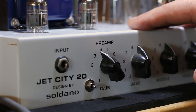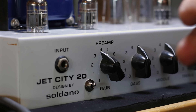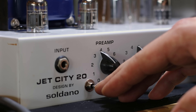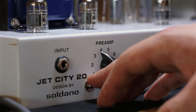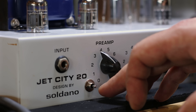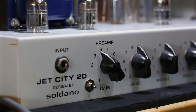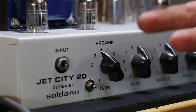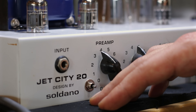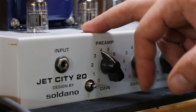The EP3, if you're not familiar with it, is the Echoplex unit, and a lot of great guitarists got their sound by running through just the preamp part and not actually using the echo at all. It's a very close replica when you look at the schematic versus the tube stage. The classic thing about the EP3 is that the original one everyone loves actually had a mistake in the design — they overcompensated a little bit, and that's why everyone loves it. It colours your sound in this really nice way, adding a little bit of crystal sweet top end before it goes through all the rest of the stages of the amp, and that's what makes it so cool. If you've ever played with one of those EP boosters or EP3 preamp pedals, they are really, really fun.